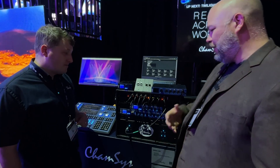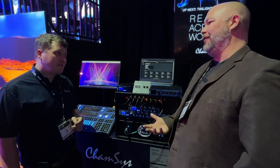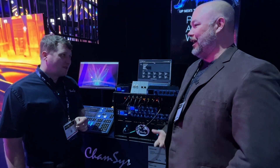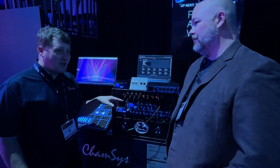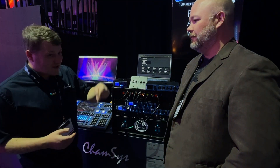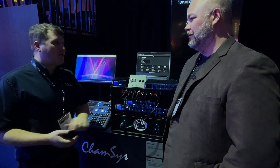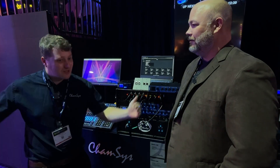That's really powerful — gives you a lot of flexibility with your rig. One thing I always like about these is you don't get locked into one universe, which is the downside of the old copper methodology. Whatever is plugged into that cable is all you get; with this you can just reassign it. And speaking of copper methodology, Genetics also supports DMX redundancy via loopback. You come out of your last fixture and back into another port on the node, creating a loop of DMX. If something fails — someone breaks a DMX cable or something gets unplugged — you've got redundancy, and DMX can go both ways around the chain.